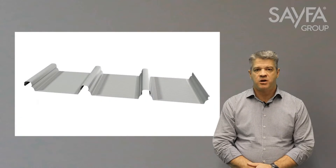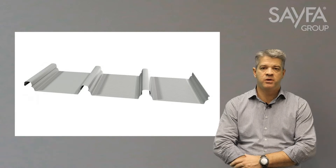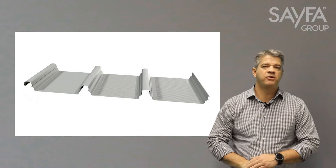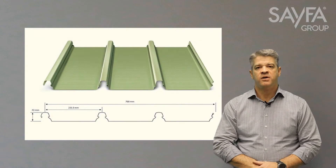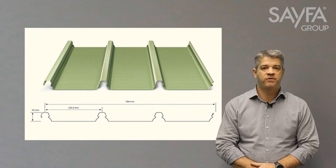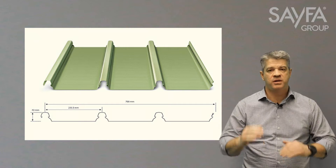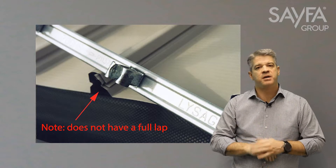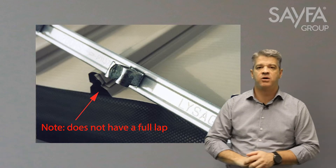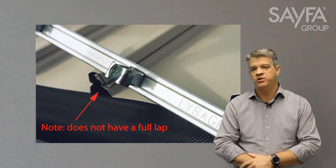With reference to 15kN and the roof sheet taking these loads, clip-fixed roofs are only clipped down and not physically fixed into the purlins. When installing an anchor on these types of roofs, you must understand that huge forces are involved. 15kN is approximately 1.5 tons. Are you sure that your roof sheet will take these loads? How do you know that the clip-fixed roof sheet will not just slide off if a fall did occur? In most cases the anchor or roof should be screwed through to the purlin beneath to stop the roof sheet from sliding.